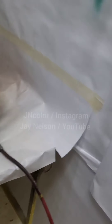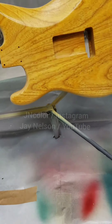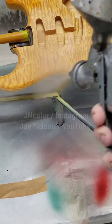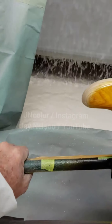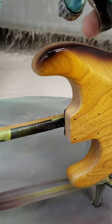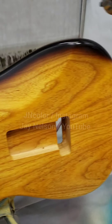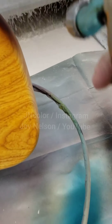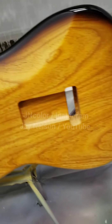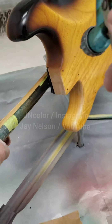First I'll put on yellow — some people might like it just like that, but on this one, that's not how it's going to be. I'll put lacquer on now — it's thin lacquer — just to give myself a nice smooth uniform surface to do my burst. I'll start with the sides and do a more narrow burst than normal, because you want to preserve the quilted wood. The dark salem is the only color that's actually opaque, so that's why I'm going to make a narrow burst. The yellow and the red are transparent — you'll be able to see the grain.